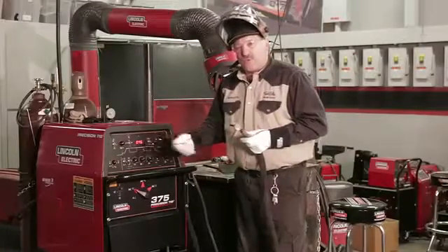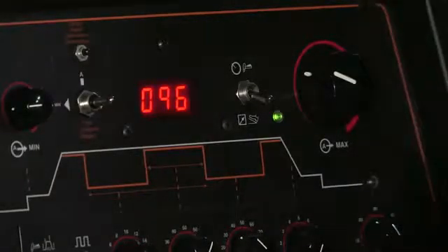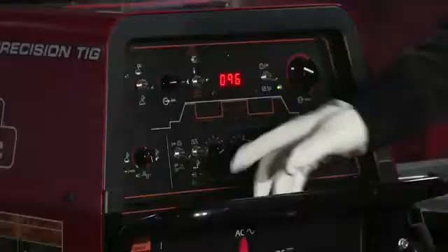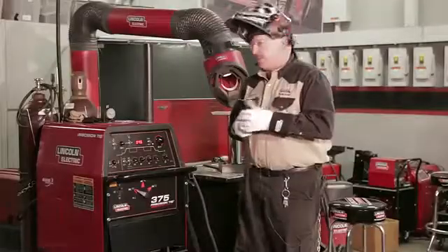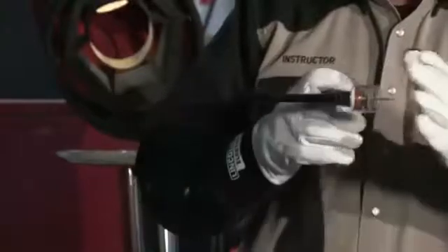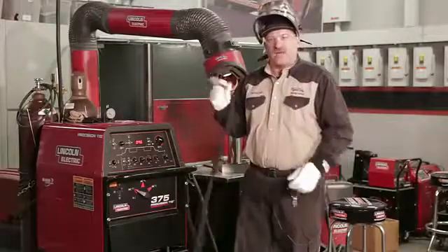Here is my remote control switch, so I'm going to be controlling my current with my foot pedal. I've got my maximum current set around 96 amps — I'm guessing I'll probably be running about 80 amps when I make this weld, and I'll adjust the current with my foot pedal as I go. I'm not going to use any pulsing on this particular job, just a steady current around 80 amps. I've got four-step control, the pulsar is turned off, and my post flow is set to about 20 seconds — that's how long the gas stays on when I'm done welding. I'm running about 35 on my flow rate, a little higher than normal because of the large area I'm covering. The tungsten is extended a little farther than normal, about three quarters of an inch beyond the Pyrex cup, because I'm getting back behind an acute angle. With this big Pyrex cup and the high flow rate, I should be all right with that.